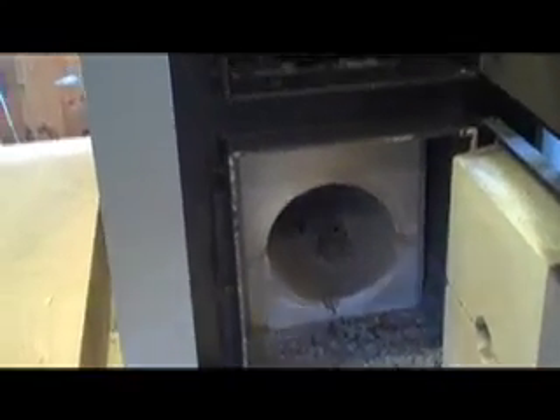Here's your traditional equivalent of a wood stove in your house box. The burn does not go up — the smoke doesn't travel up like a traditional wood stove. There's a slot in here that will suck it down into this ceramic chamber, and then air is reintroduced in that ceramic chamber. There are some holes just about right in the middle as the flue gas is going down into there, and that air reignites with no apparent fuel source.